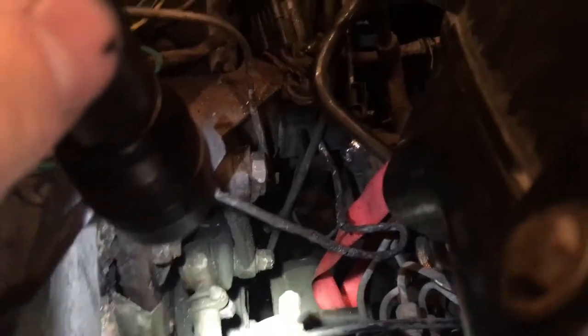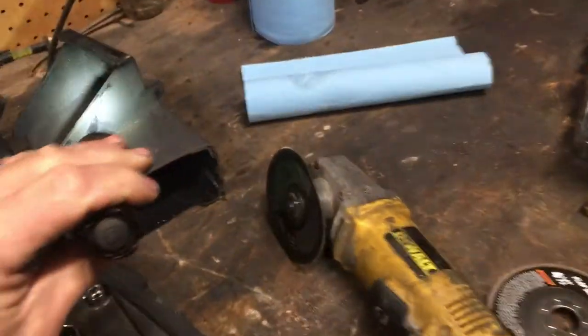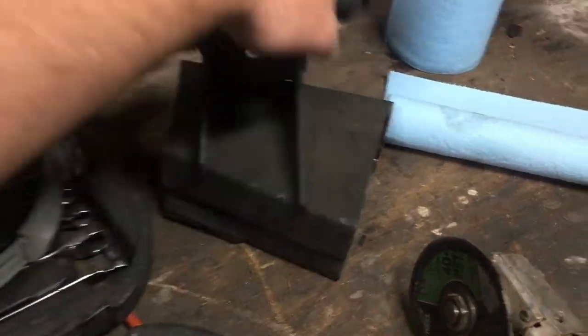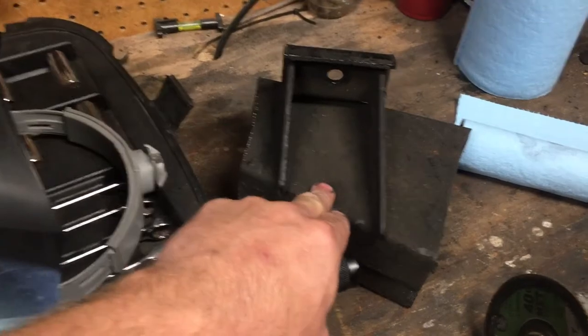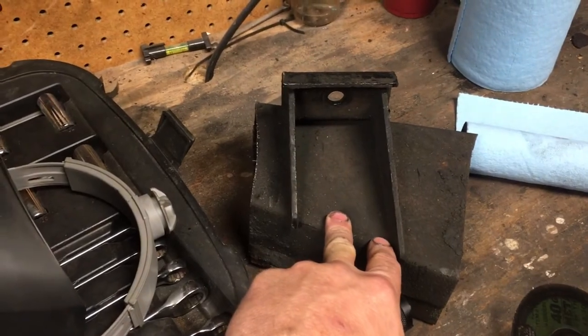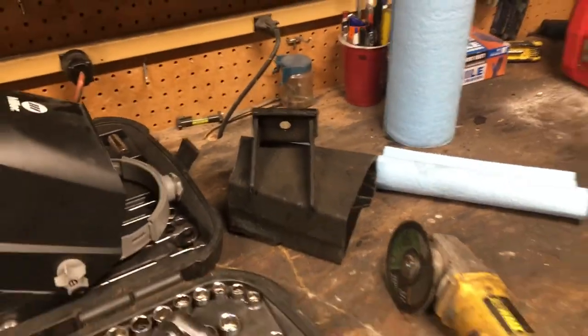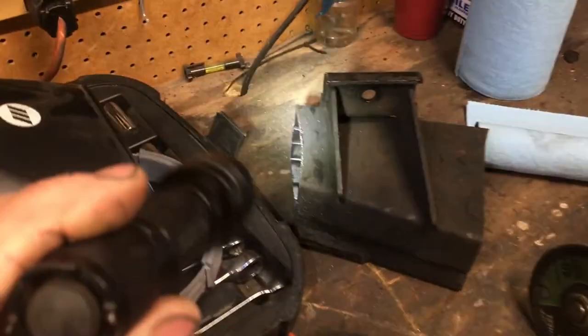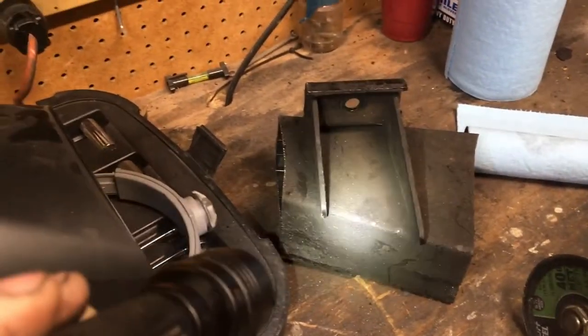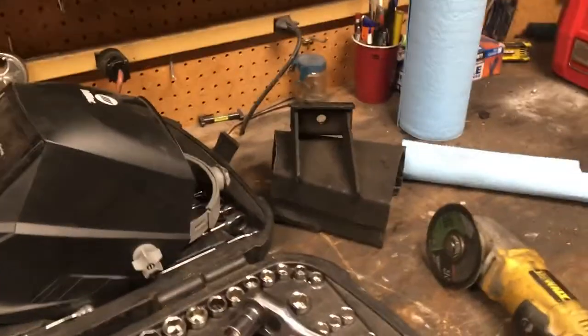The other side I'm actually sitting a little further away from the frame, so I might have to modify the piece by not cutting quite as much off, or leaving more. I might cut the entire piece off and leave the wall to get that extra eighth of an inch of thickness, and see if I have to shim or do more behind it to get it where it needs to be before welding. When I say shim, I mean building it out with a 3/16 piece of steel or something like that to get it further out. We'll see how close and tight it's going to be and figure it out.